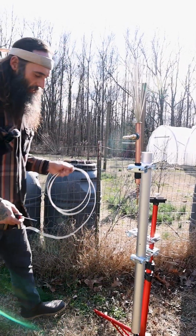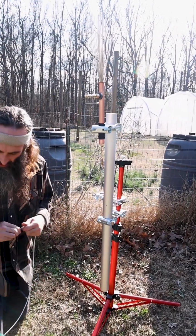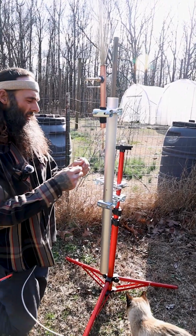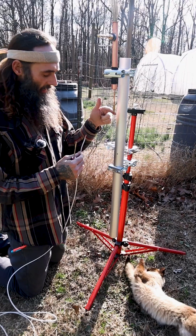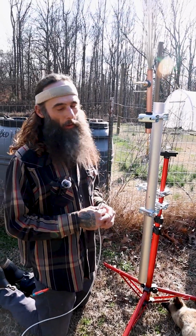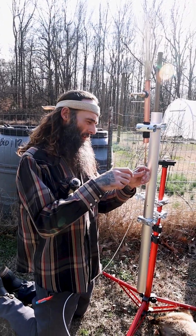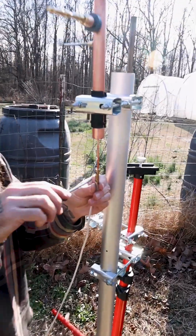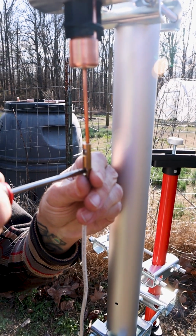This is a demonstration of then how I'm using a 10 gauge insulated copper wire that would just traverse the distance from this connection point to the antenna to the ground, and where it meets the surface of the soil, it will couple again to the galvanized steel that runs in the soil. So here we have our brass coupler. We just couple this wire to here.